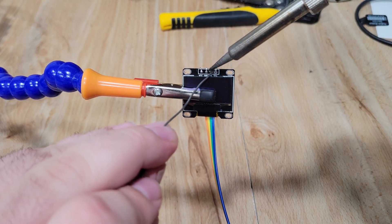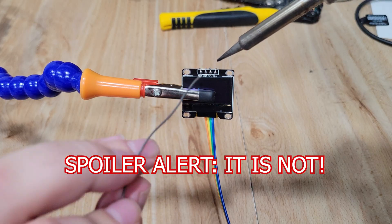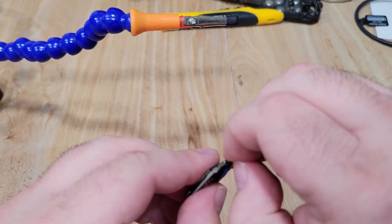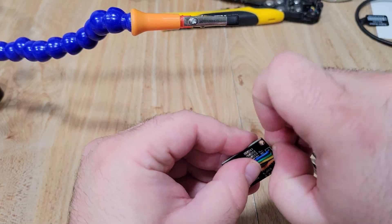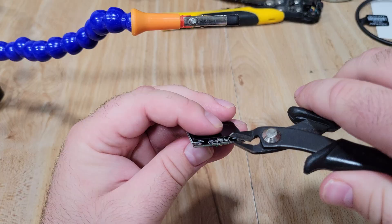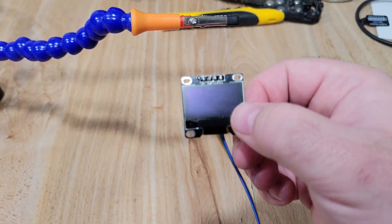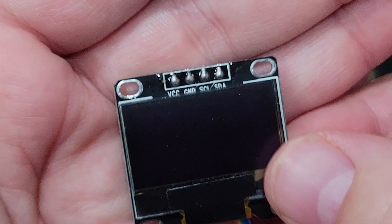I started by feeding one wire through and soldering it in place to anchor everything, then fed each of the other three wires through their respective holes, folded them over a little to anchor them, and got to work soldering the last three connections. These last few solder joints came out looking not completely awful — maybe my streak of not being able to solder on camera is coming to an end. The connections are VCC, Ground, SCL, and SDA, corresponding to the headers we installed on the main board.